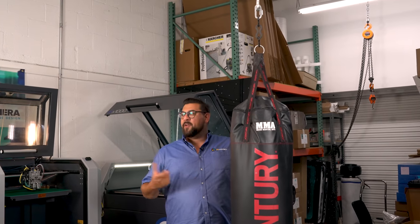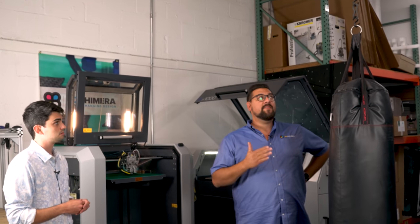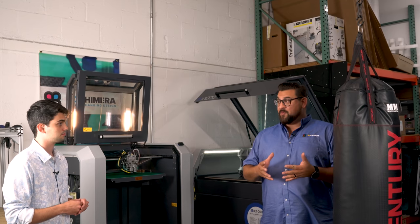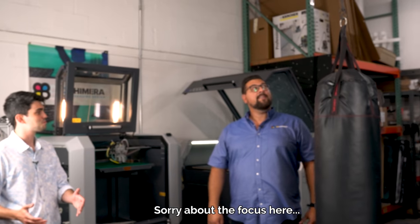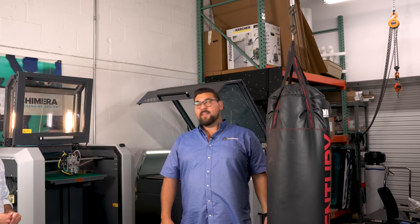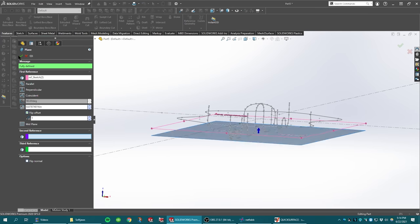What is the application for the part we're looking at? It's for stabilizing a lead screw, so it's not under super high mechanical stresses, but my buddy needs about 50 of them. That might be the perfect fit for this technology, because in SLS we can build really strong, robust parts — perfect for engineering-grade components. And it's also a batch process, so for us printing 50, we could do that overnight — you could have 50 parts the next day. So you're telling me you can print my soft jaws as well as the final part? Yeah, I think we could try it. We could print maybe all 50 of them and I'm pretty confident it's going to work perfect for your application — maybe we can save the time on that CNC work for you.